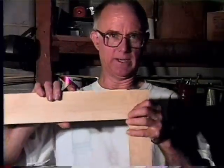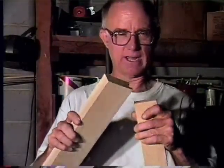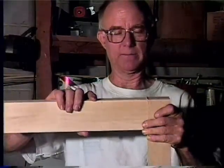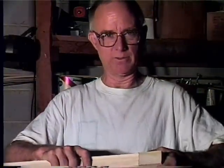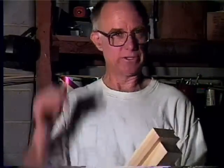But all we're going to do, we're going to set up to do a square butt lap joint, and that's where we cut everything in for the glass. It's a butt joint, but it's also a lap joint, which is real good for stability to keep the window together. And plus it makes it easier, if you're trying to, let's just say, put some leaded glass in from an original window, well, this will get you to where you can do that without a lot of trouble.